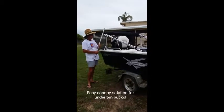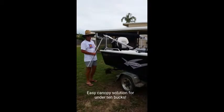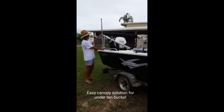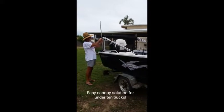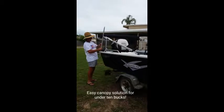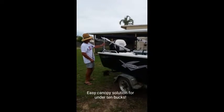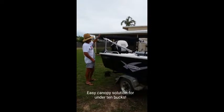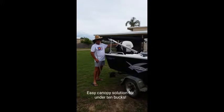I'm going to show you how to make a better canopy in under 2 minutes and in under 10 bucks. Generally most of the canopies on these little tinnies have the long stanchion that's a permanent fixture. What I've done is cut it in half and just put the fittings of both the stanchions on either side to make that small. So you can have that half size structure permanently based — it's less wind resistance, it's out of the road. And having it shorter like this actually protects the motor if you're going through mangroves or a bit of bush.